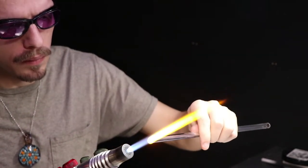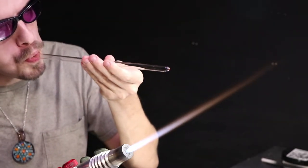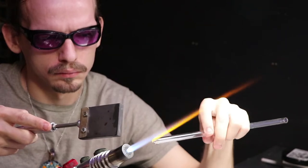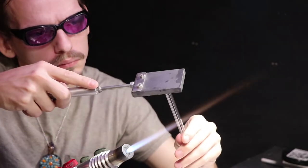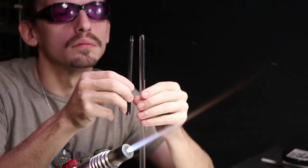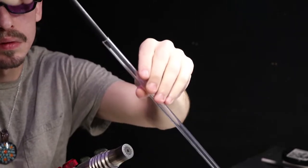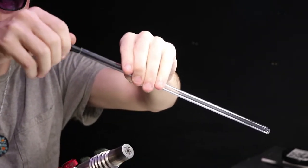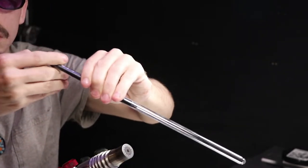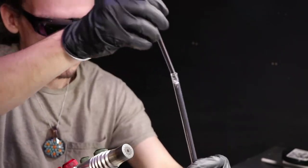And so I'm just heating up the end and puffing out a little bit to fit better for the tip of that tool. And I'm thinking the solid core version should work a little better. I did some tests with a permanent neodymium magnet using the powdered iron wand versus the bolt experiment from this video. And the bolt experiment did a lot better with the neodymium magnet.